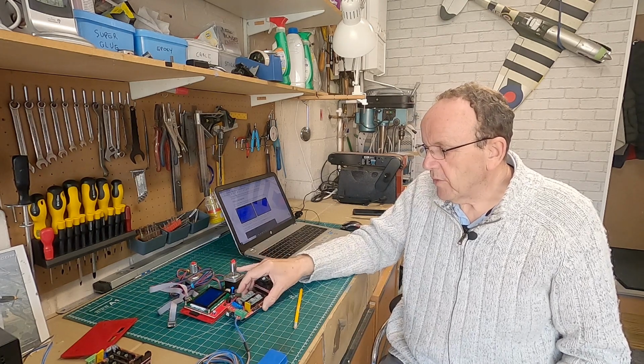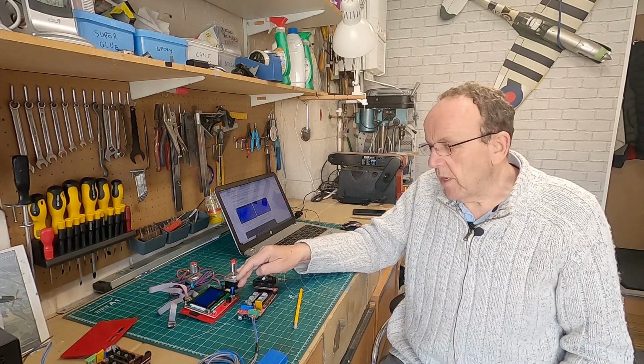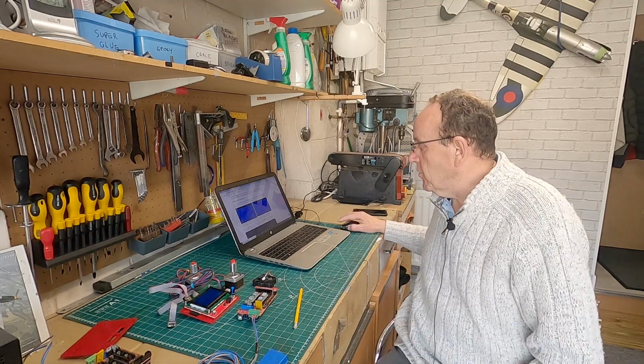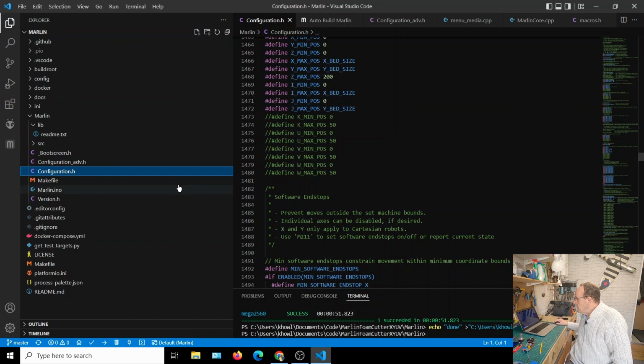So if you find you can't swap the wires around on the board, it may be because you've got an MKS board and it's not easy to swap round. What you need to do then to change the axis direction is go into the software. Now on the website, I've got full details of how to do that, and it shows you what to do. So what we'll do here, we'll go onto Visual Studio Code, and you need to make the change